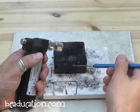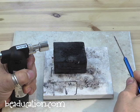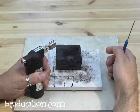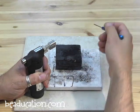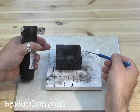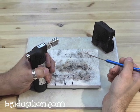Sometimes you need to bring the torch so that the flame is horizontal, parallel to the work table. Now we've taken the flame away from the safe work area and it's pointing out towards other things, so it's important to keep in mind how far out that flame reaches. Keep this area clear of paper and plastic that could melt, but also when pointing out this way, make sure that area is safe too — this is where you might accidentally burn a hole in your water bottle or melt your flux cup. You can place a larger fire brick or kiln brick out there to block the heat so it doesn't go further and protects everything behind it.